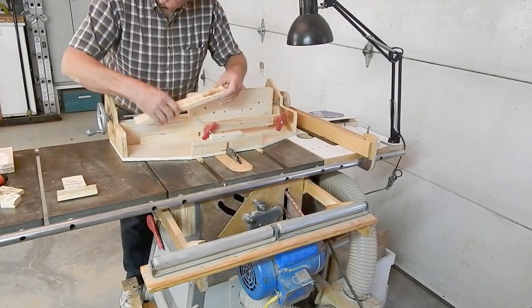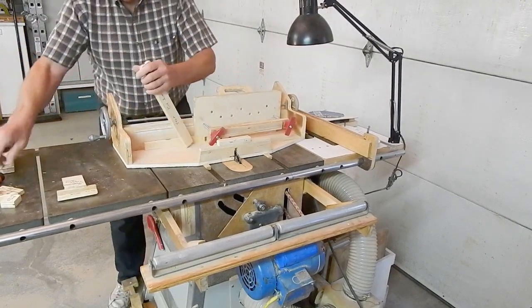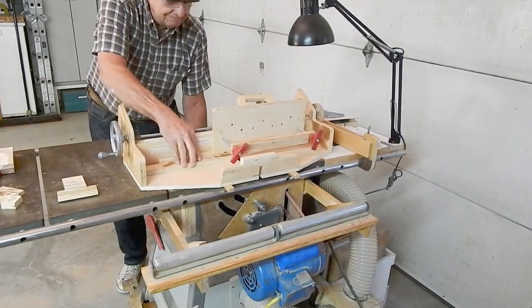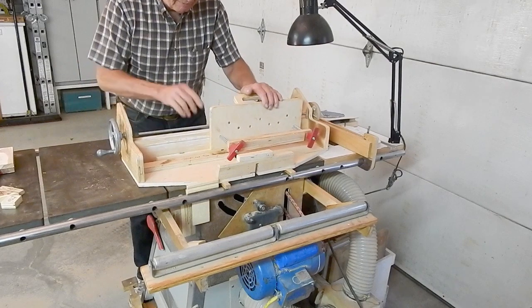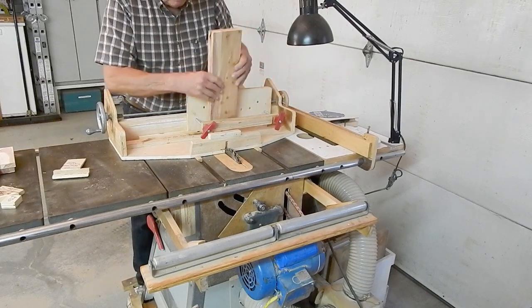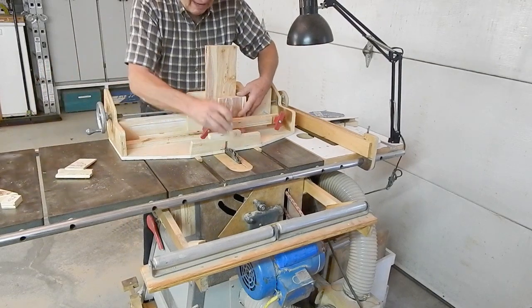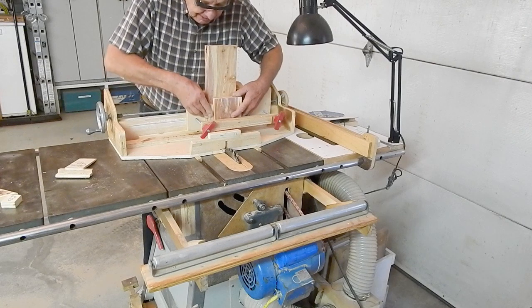There's a stop block to help align the boards. The first step is to back out the adjusting screw just a little bit and make a cut to establish the exact length of the stop block, pushing it against the side. I've established which is to be the top and the outside, and I'm installing the boards in the carriage against the stop block. Since I'm doing half-inch notches with a half-inch dado blade, I'll position the box ends with the spacer block exactly half an inch inward.